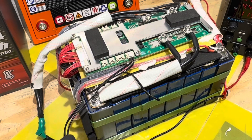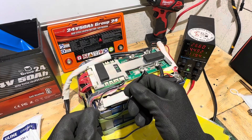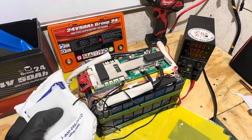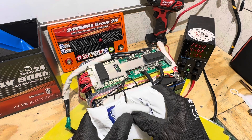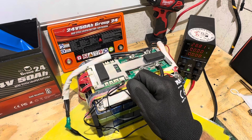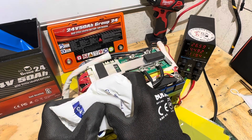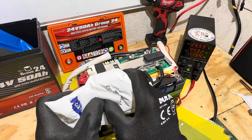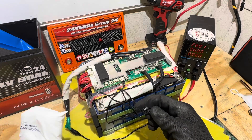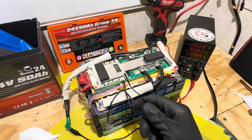With the NTC sensors pulled out, I'll check low temp protection first. Cooling the cell sensors should disable charging below freezing. It worked — took exactly one minute and disabled charging. Both sensors function properly for low temp protection, which protects the battery in case the heater doesn't work. Perfectly protected from low temp charging — very refreshing to see that programmed correctly.